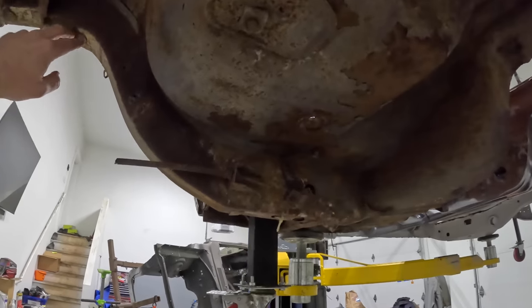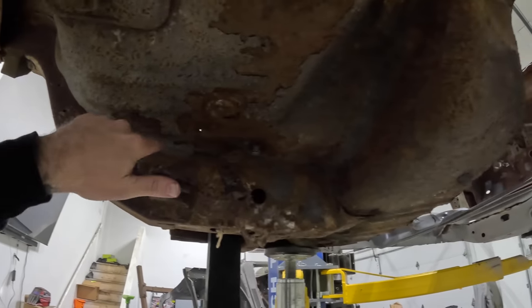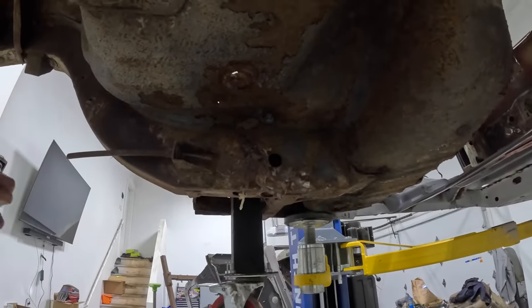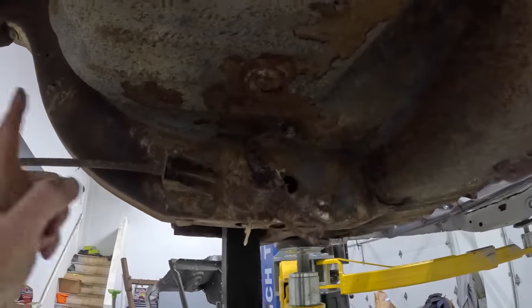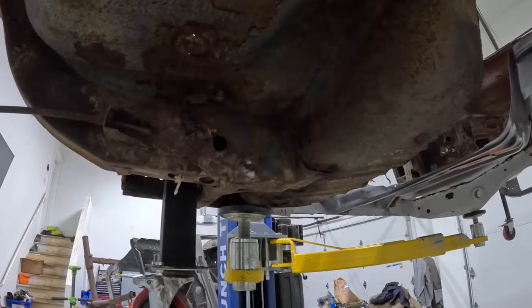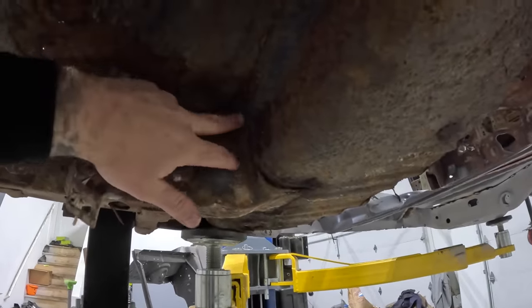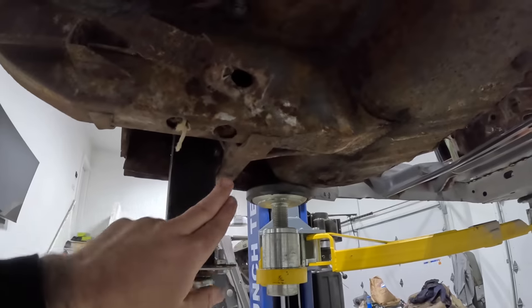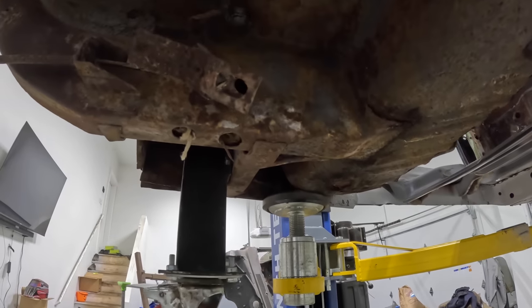Now, I like leaving the rear seat pan in when I do this, and as I go through here, just like I showed you guys how to peel the metal off with the quarter panels and everything else, I'm gonna do the same thing, almost like I was going to be saving this rear seat pan, because I wanna make sure that I've got these same radiuses with the frame rail pushed tight up against that before we go ahead and weld in these support pieces.